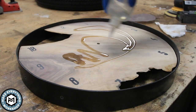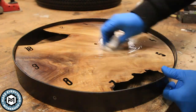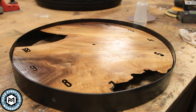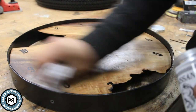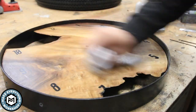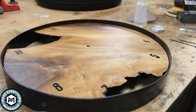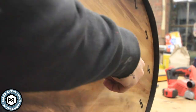The best part of any slab project is putting the oil on it. I'm using a clear mineral oil, just rubbing it in — and what's nice is that the mineral oil can also go on the black wax and will preserve it on the inside of the ring. I let that dry, buff it in with a rag, then apply some Renaissance Wax, which is a micro-crystalline wax that polishes and protects the face. I add a little wax to the steel as well for an extra layer of protection. I really love the way the grain on this walnut popped when you put that oil on it. Sanding up to a high grit is so important with wood — don't skimp on your sanding, it'll make your finish that much better.